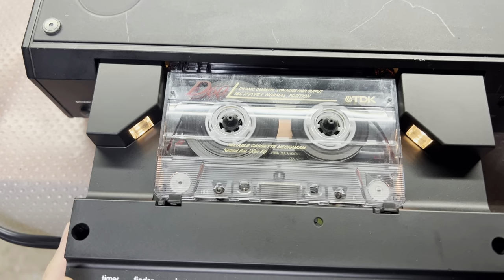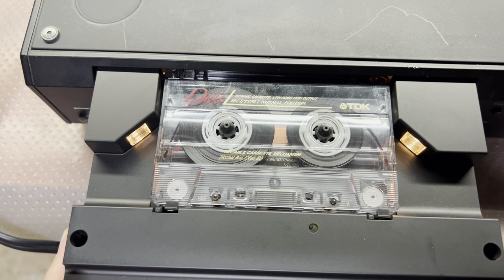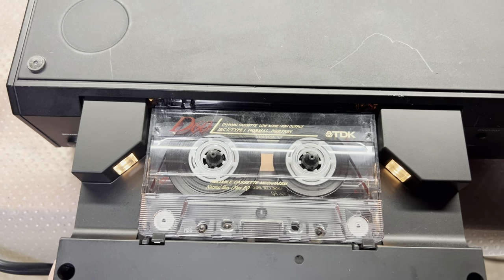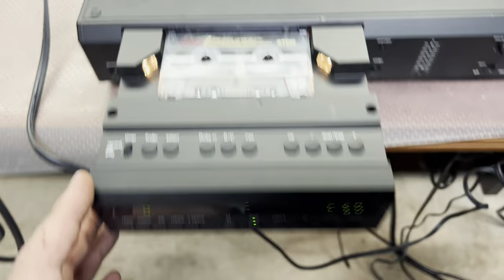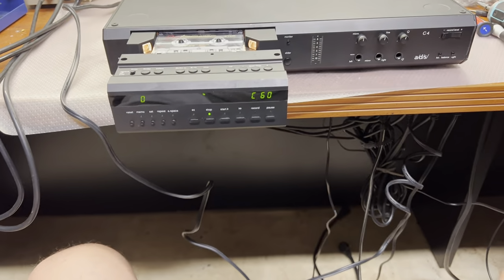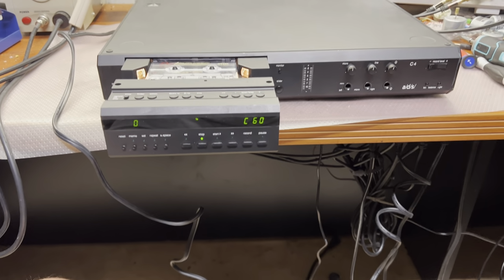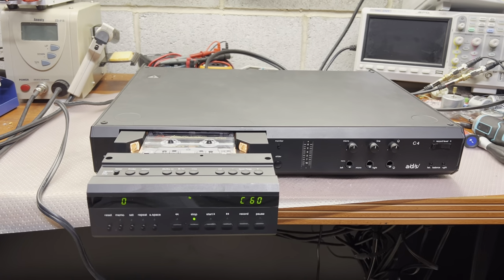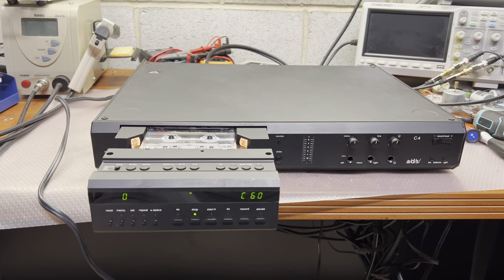Let's try it a different way. So probably it has an idler which needs to be replaced. You see heads engaged, but the capstan doesn't rotate either. Why? This would be a long story, I believe. So now let me open it and let's see together what's inside. See you soon.